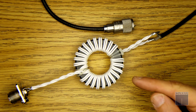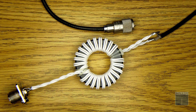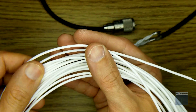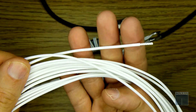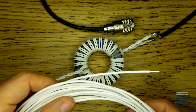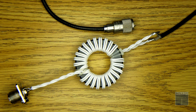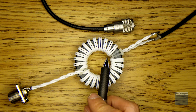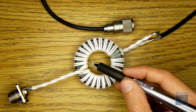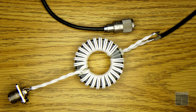So I ordered an FT240-43 core, and I got this PTFE Teflon cable from eBay, said to be silver wire, coming from China. I made one mistake: I ordered 16 gauge, which is a little bit too big. You can see the coiling is a little rough here, and I need to put both tie wraps on top of each other to make it fit.